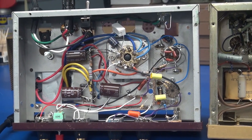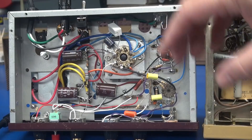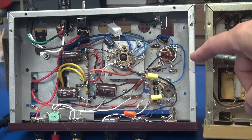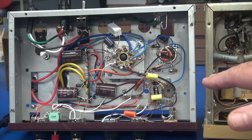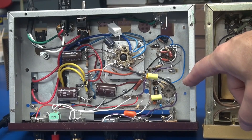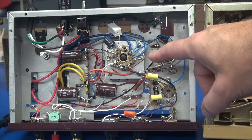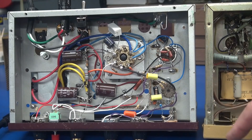You can see things are quite a bit different. This was a complete build — nothing was reused. I was able to strip this chassis, and the beauty of it is it's really clean. Everything came right out, and I was able to reuse the tube sockets on this side of the chassis for my tremolo tube and the preamp. I still had to recess the 6K6 to clear the top of the cabinet, but it came together really well.